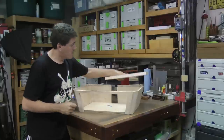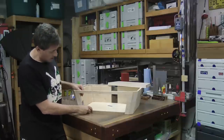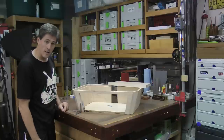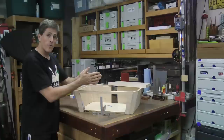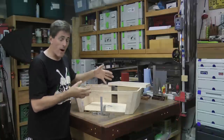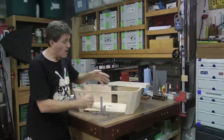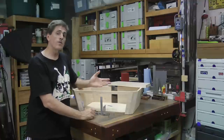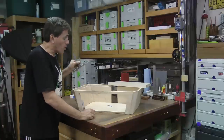Looking at this box, there are a number of angles in play — some sides are sloped and the interior is sloped. There's an angle for the opening, and the front itself is inclined. If you built a box and applied this drawer front with this much error, it would be a disaster. So I need to make a dovetail box that has sloped outsides, the front sloped towards the front, and the back straight vertical. Counting those compound angles: two mirror compound angles in front and two different mirror-image compound angles in the back — four total to cut for each of three boxes per unit of Angle Madness. And I'm building two units.